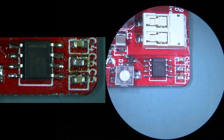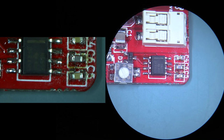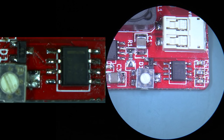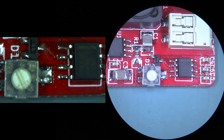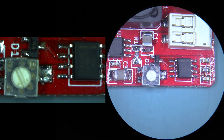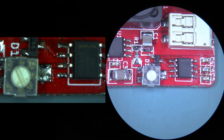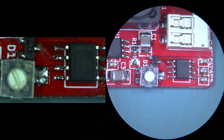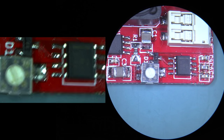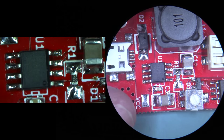Of course, it just drops down to 17 frames per second at 1600 by 1200. But the big problem, look at the frame size. Look, it is totally cropped. It's just ridiculous. You get a substantial bit more frame at 1600 by 1200, but still not as good as the optical viewfinder. So it really is punishing you by cropping that image. But hey, the frame rate is adequate, but this is not what it's for.